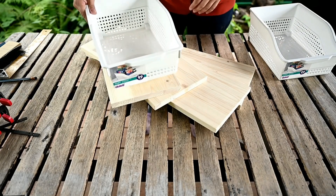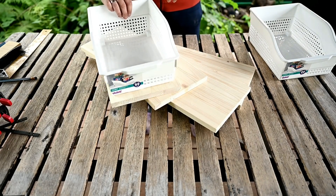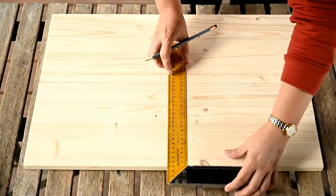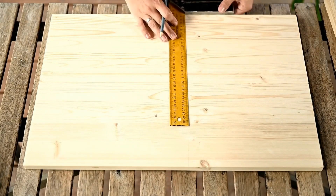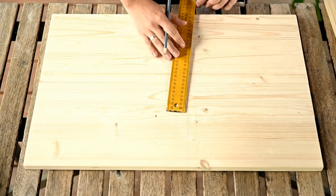I've ended up with two long boards 24 by 8 inches and two shelves at 12 and a half by 8 inches each. I picked the size using the height of the bottles and jars I'll put here as a guide, as well as the size of the Dollar Tree plastic baskets which I'll use as inserts — I want them to fit snugly on the shelves. I'm marking where the shelves will sit.